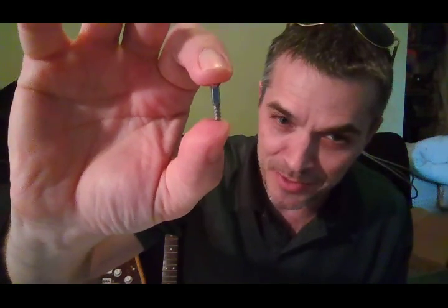I believe what happened was they drilled a hole big enough for the shank because they were using the wrong screw — all the other screws were proper. This hole was drilled bigger and somebody set the screw in and whacked it in with a hammer, because it was driven in more like a nail. That's why it was turning but not backing out — there was nothing for the threads to bite. Finally, wedging with the chisel and turning gradually brought it up, then I finished with a little miniature pry bar, a cat's paw, and that took it the rest of the way out.